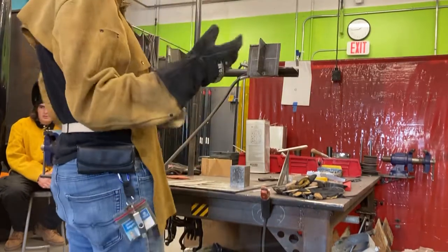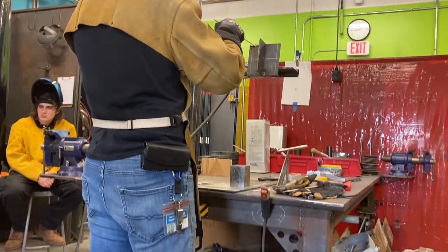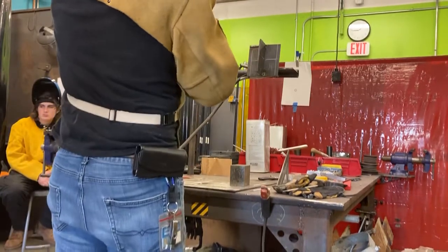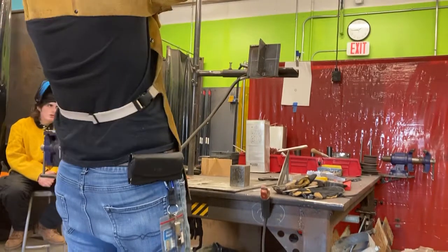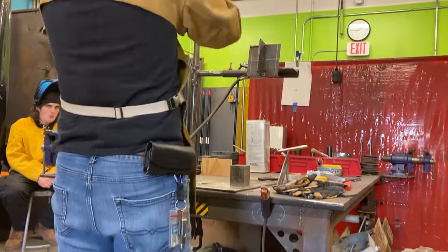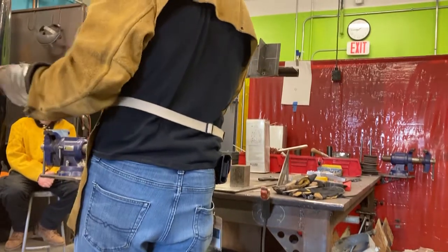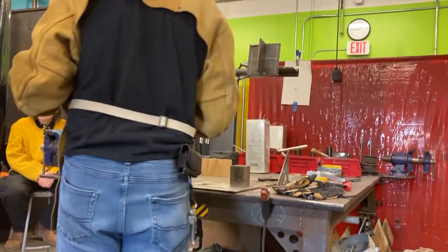Backstitch weld: in a case where I'm welding this plate vertically, the heat is going up and I'm going up. Backstitch welding means instead of welding on one end, up the way the heat is going, I'll start a third of the way down and go up, up, up, so that when the heat goes this way, I'm going that way. So I'm actually welding towards the colder part of the plate every time. We'll practice that later on.